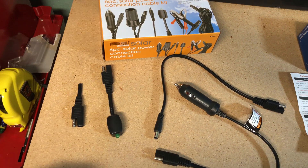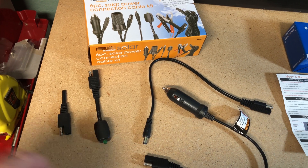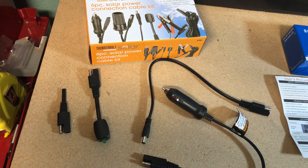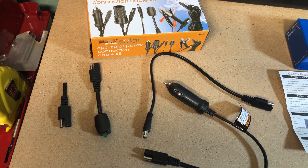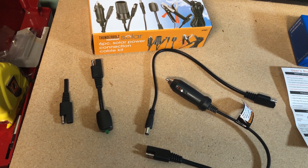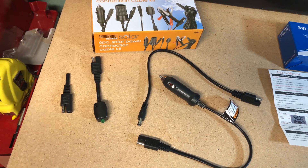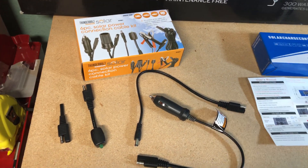A couple of the other items: I cut off a cable I'll show you later. This is a tester for polarity. One of the challenges with SAE connectors is you have to pay attention to polarity. The way the connectors work and the pre-made cables work, it's very easy to flip polarity — so it is something you need to pay attention to.